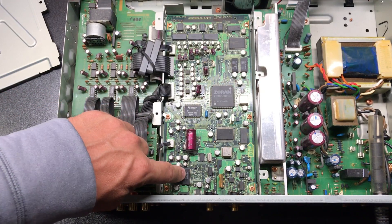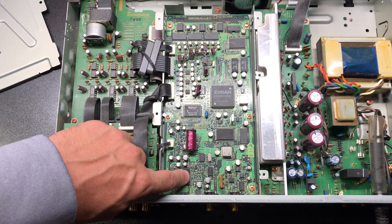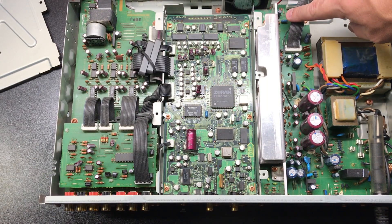This IC should be the one that we're going to tap into for the digital feed. A positive five volt is on this board, and then there's a ground connection over on this board.